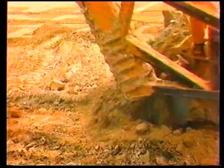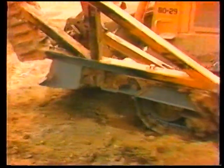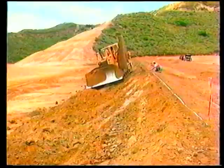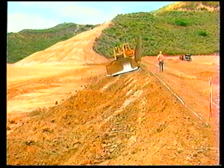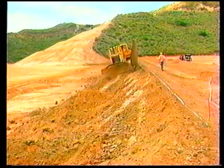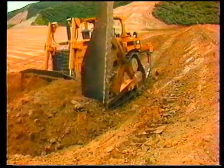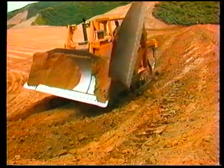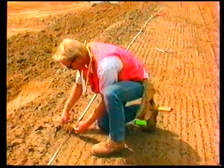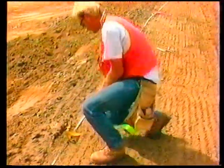As the dozer fills with material, turn the dozer away from the slope and lose the material onto the bench. Back up to where you left off and begin again. Continue this process the entire length of the slope until the grade of the slope is within 4/10. Then, using the corner of the dozer, push the excess material off the bench and re-establish the toe of the bench. It's advisable to use a grade checker when establishing the top, toe, and slope ratio of the slope.